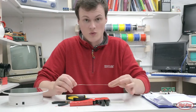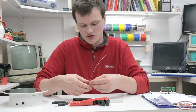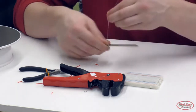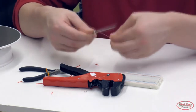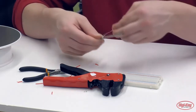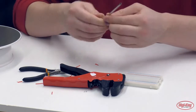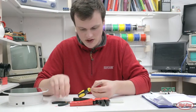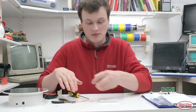Let's build the spring. We have a piece of solid core wire with the sheath taken off, and we're going to turn this into a spring. You don't want to make the spring too big — keep it rather short and fat, just a couple of turns, just enough for the antenna wire to sit inside. Turn it into a little spring like so, and you can neaten the edges so they're both the same size.